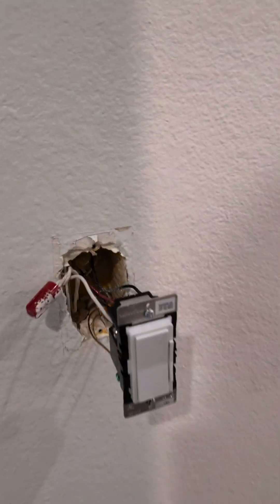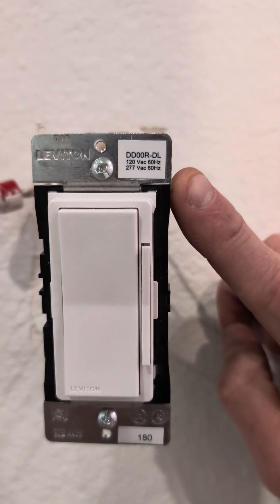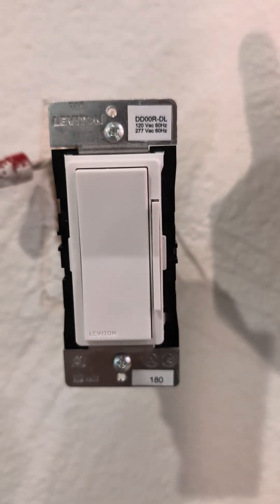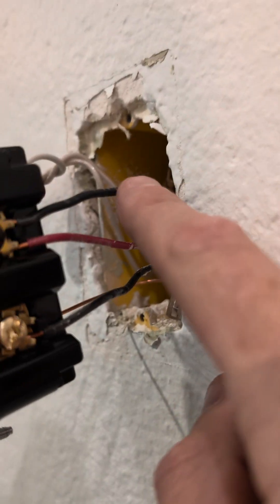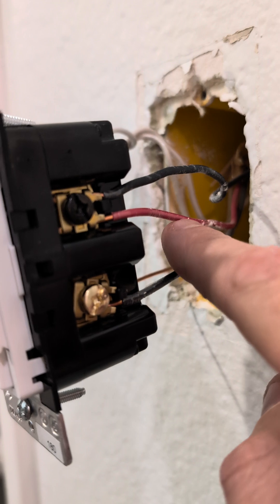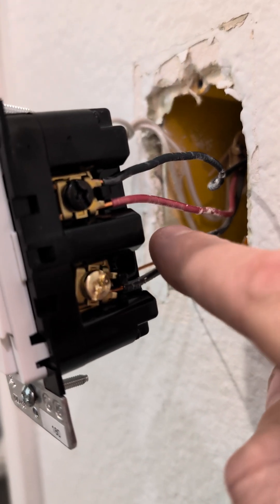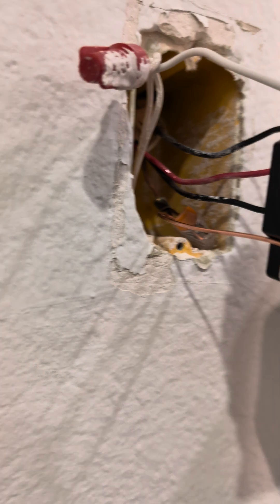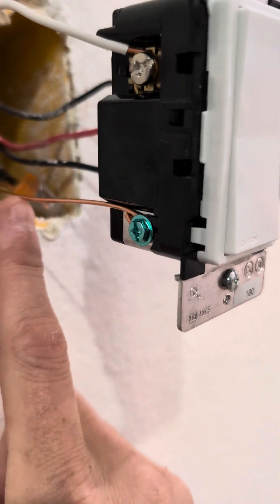The DD-00R companion switch actually needs to be hooked up to where the wire comes in from the breaker. So this black wire on top comes in from the breaker — paired it with the red, then hooked up the remaining black to the bottom here, pigtailed in a white, and then connected up the ground.